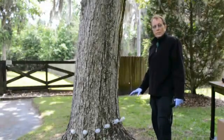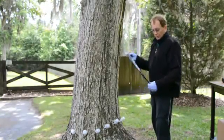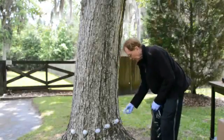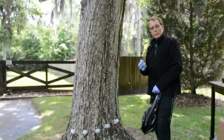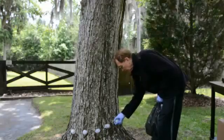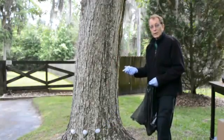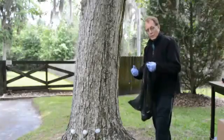After these units have drained, they simply can be removed and the process is quite easy. Make sure that you have your collection bag handy. You'll approach a unit and twist it — rotate it slightly left and right and pull outwardly as you're rotating. It's highly unlikely that the tip will ever separate from the conical section and remain in the tree. If so, you can remove it with a pair of needle nose pliers quite simply. If you just break that initial tension, rotating left and right as you pull outwardly, the unit will come out with the contents completely drained. Keep in mind that there may be some air pressure still in the unit if the fluid is not drained completely, so you must be careful to always wear your personal protective equipment and stand behind the units with your gloves on.